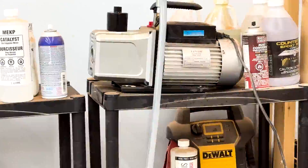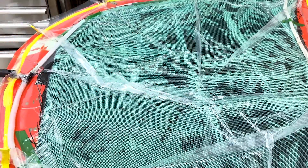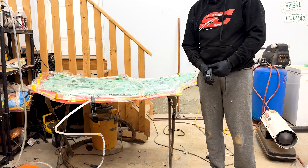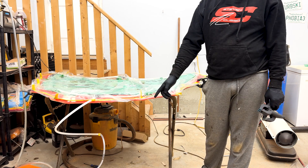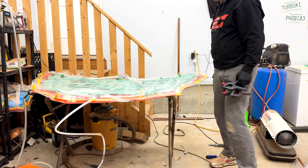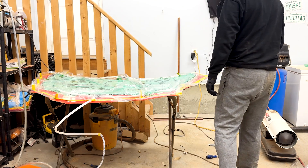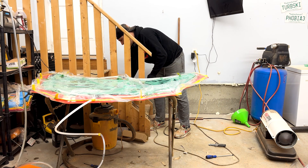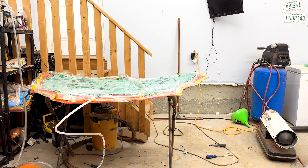I just came back from lunch and that doesn't sound too good — we've got air everywhere. I don't even know what to do right now. I think what happened was the pump died and stopped creating a vacuum. All of the air in the resin pot that collects the excess resin — I think it all backed up into here. This is a disappointment: there are several hundred dollars in material here. We spent a month making this mold to get to this point, all for my vacuum pump to die. The vacuum pump is very cold. Life goes on, I guess.